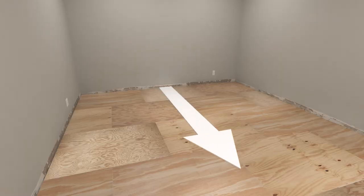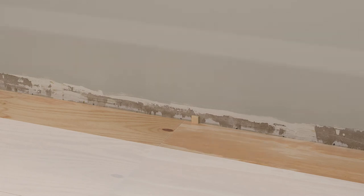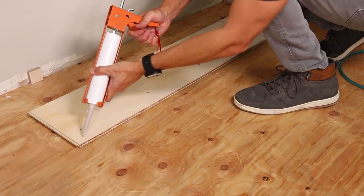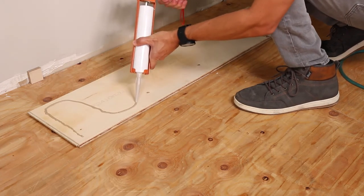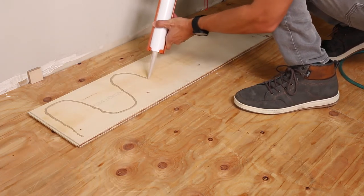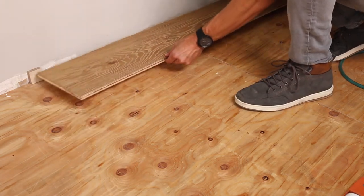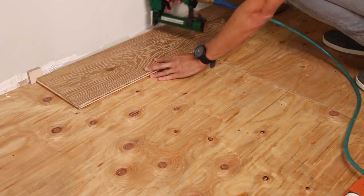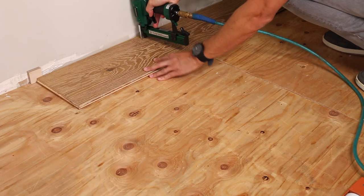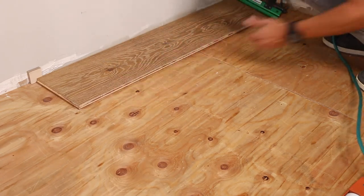The final row should be at least three inches in width, which means planks in the first row might have to be cut or ripped lengthwise to a thinner size. Secure your first row by applying the adhesive in a snake or serpentine pattern across the entire width of the back of the planks. We recommend applying the glue to one plank at a time, but if you're more experienced or have help, you can do multiple planks at once. Just be sure to lay the planks within about 10 minutes, or according to the manufacturer's instructions, before the glue starts to dry.